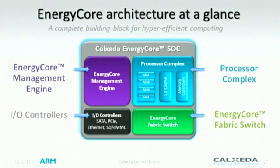It's also got a fabric switch. The fabric switch is probably what analysts have called our secret sauce or our secret weapon — this is what really changes the game. Frankly, anybody with a decent set of engineers and some money can go get an ARM license and build a quad-core ARM processor. But to turn it into a server, you've got to be able to scale it. Scaling with lots of Ethernet cables connected to top-of-rack switches, when you're talking about thousands of nodes, is a non-starter. So what you have to do is start fresh — with a distributed layer 2 switch called the Energy Core Fabric Switch.